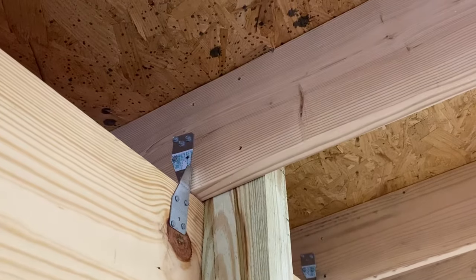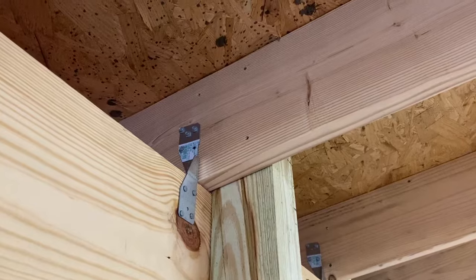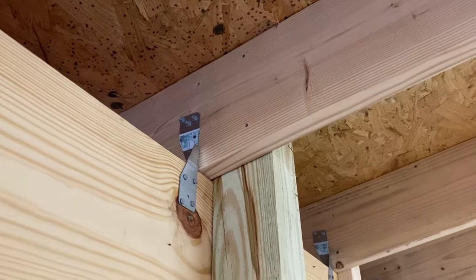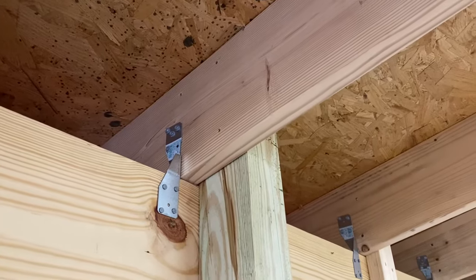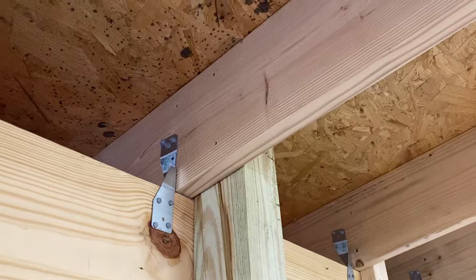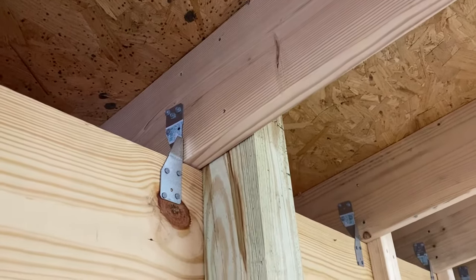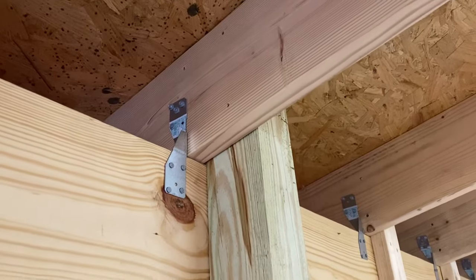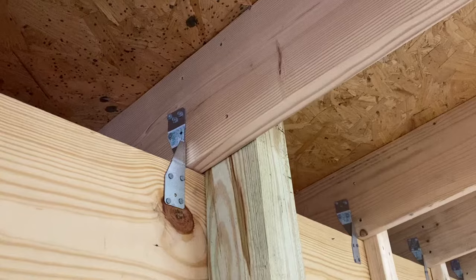If you can tie that roof directly into the post and then the post into the footing, that's very, very strong uplift resistance. And so when you're doing a pole barn and laying out your poles, start by laying out your roof framing, and then it doesn't take much movement. Most times, if you're doing this with 2 foot increments on your roof and your poles are nominally about 8 feet or 10 feet apart,